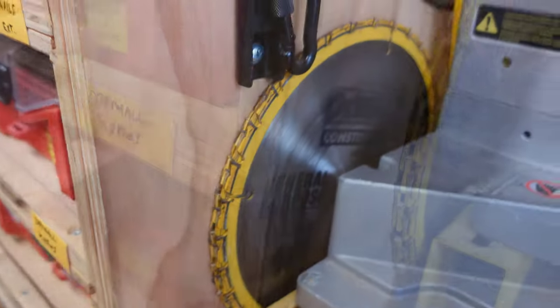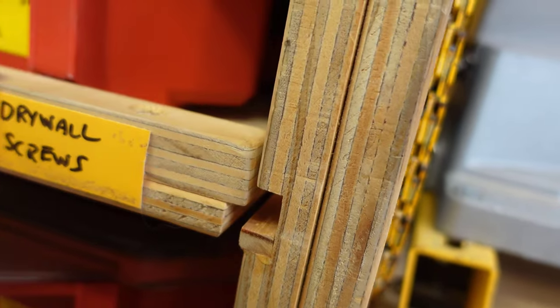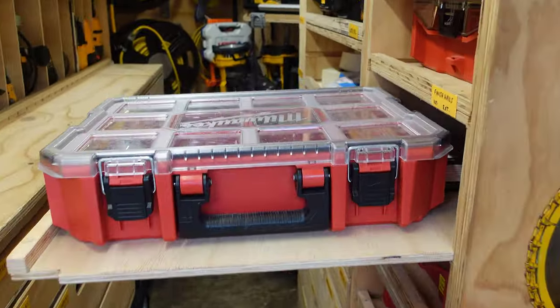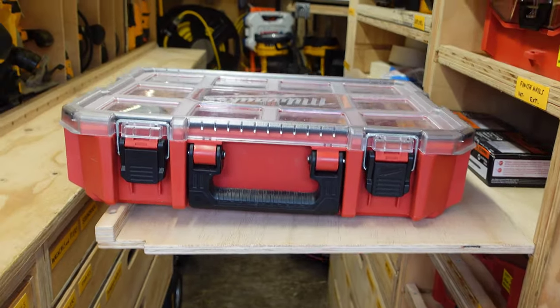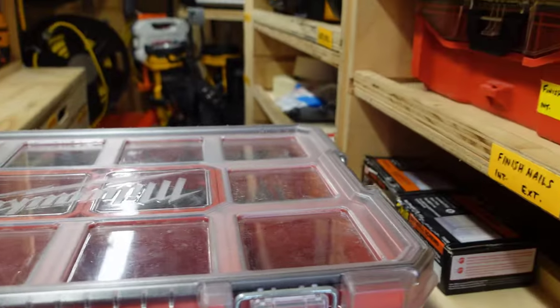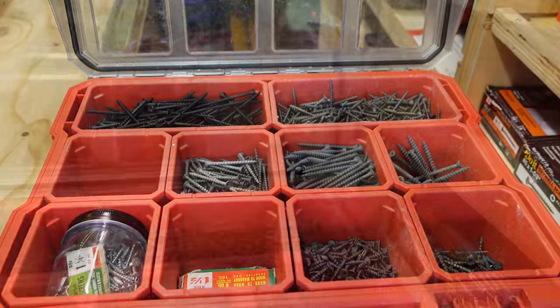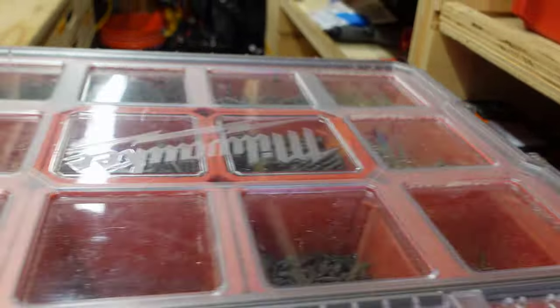All of these shelves do pull out: lift up, pull forward. And what'll happen is, you can see where that notch falls behind that piece of hardwood right there. And then it falls down in. That keeps this from pulling out during transit. So if I want to access these screws, that's what I do. I can then pull that just over there, let that cantilever, and then I have full access to all the screws. And that would be true for all of those organizers. They can all work the same way. Slide it in,